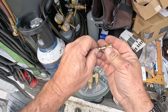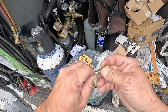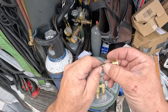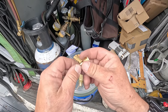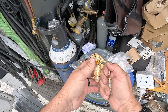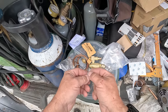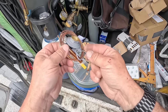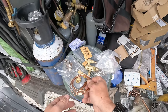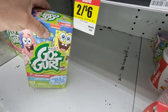On the other valve, this rod was all gummed up — I couldn't even pull it out of the body. I literally had to clean it up with sandpaper and a wire brush wheel. Since we're going to sweat this in, I'll do that first and then put in the other components that have seals that can get destroyed by heat. We'll go ahead and put the head on now so anyone coming along knows exactly what kind of head it has.